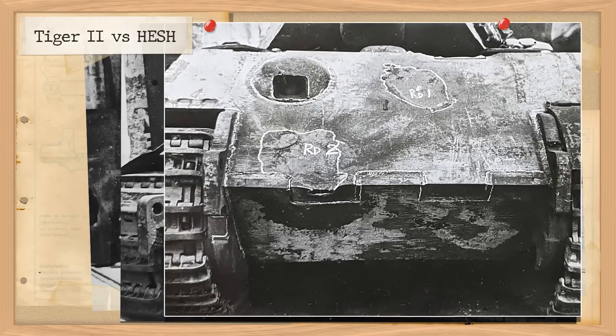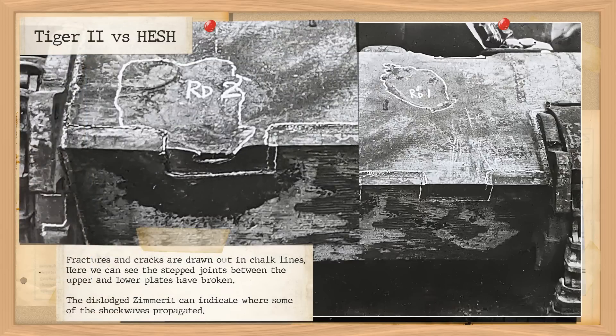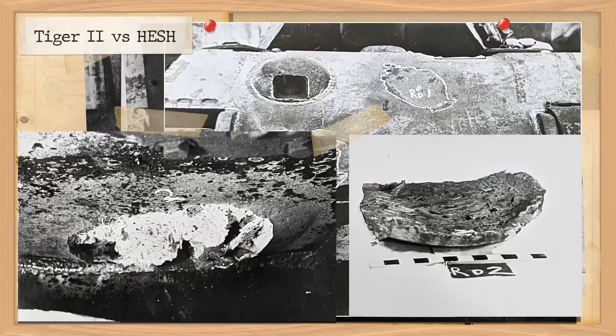The second round struck at 30 degrees off-centre to the Tiger's gun, representing the vehicle attempting to angle its armour. The front was dented 18 by 17 inches and one inch deep. The welds between the upper and lower nose were severed, and cracks formed on the glacis side. To the left, the upper hull and pannier sides developed a long crack, while the lower nose and hull floor developed a 17-inch fracture. Internally, a 15 by 13 by 1.5 inch scab weighing 74 pounds formed and destroyed the mock-up transmission. Witness plates indicated that apart from a mobility kill, the crew would have survived this shot.